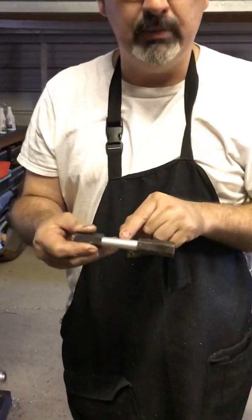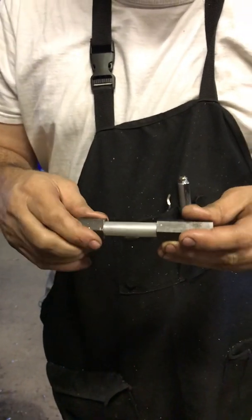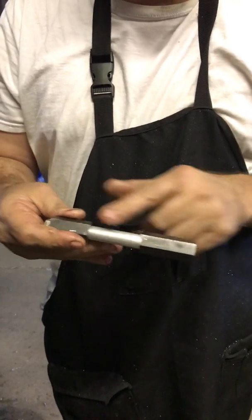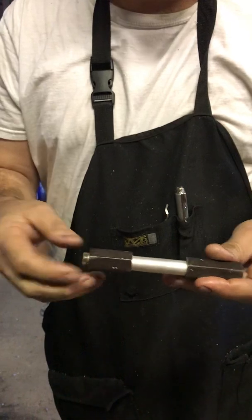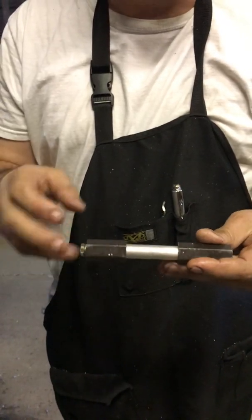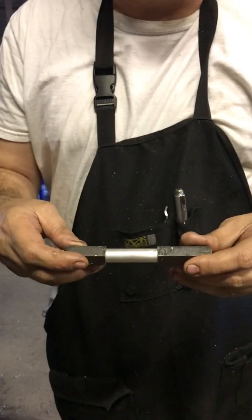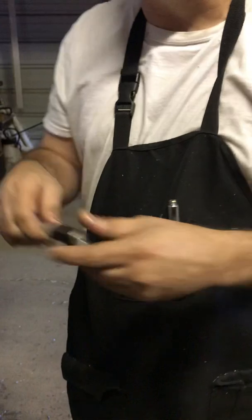Being totally blind, I had to design a jig fixture that I could machine the parts by myself. I took two pieces of hex stock, machined a shoulder, threaded one end, and put a bolt in the other end. This end has a shoulder too, so it centers my pieces. I can cut a groove, index it one flat, lock it down, cut a groove — I'm going to show you a little bit how it's working.